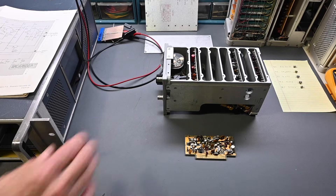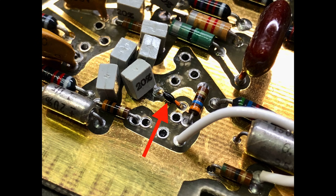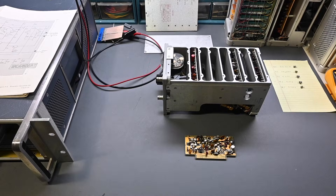As I was starting the troubleshooting on this plug-in and working on that circuit board, in the previous video I had mentioned that there's a device on that circuit board called a tunnel diode, but I didn't go into the details about how to test it. It's just a small speck of a part on that board and quite delicate. Tunnel diodes have some very unusual properties, so if you try to test them with a digital multimeter in the diode check function, you'll just get a very low voltage drop in both directions in most cases. And if you try to test them in resistance mode, it'll look like a low resistance — so you might think that the diode is shorted. Let's take a look at what actually makes the tunnel diode so unusual, and then I'll show you one of the ways that you can test it.